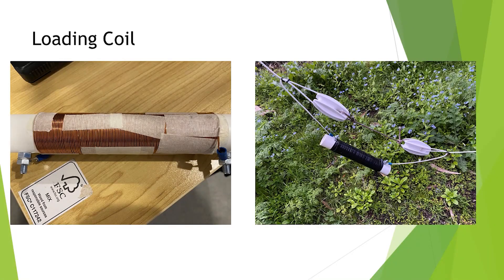This is the one I came up with. You can see all the masking tape I used to keep the turns together and make it look as neat as possible. On the right I've got two egg insulators so I'm taking the strain off the lugs. You can heat shrink that as well — I used amalgamating tape, but you can use glue-line heat shrink if you like. It's fairly light when you pick it up, but when you string it up in the air it gets heavier, and that's what the egg insulators are for.